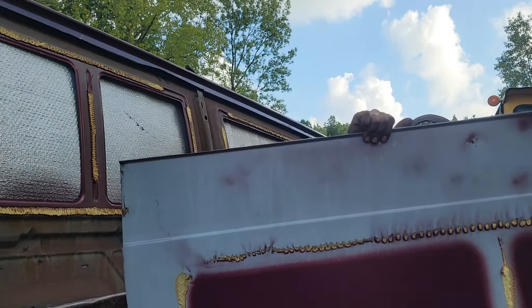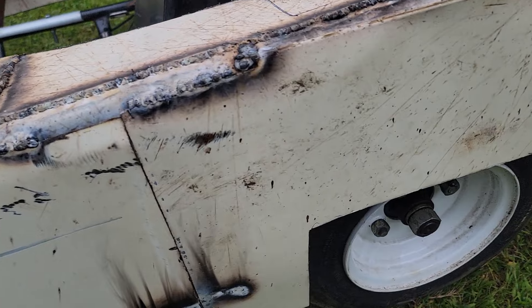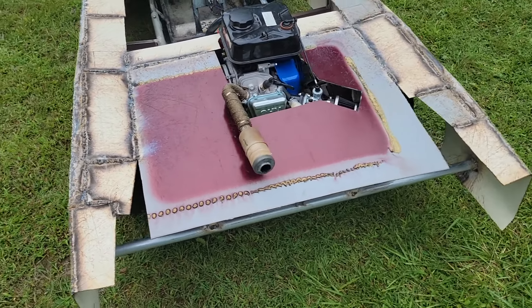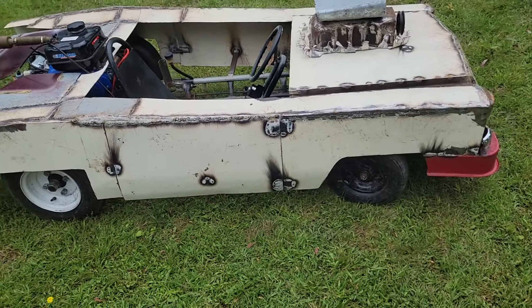There's still a lot of work to do, but I wanted to show you what I did for the body mounts. I got four pieces of pipe — one on the back of the frame coming out to this piece of conduit, and one in the front doing the same. The two side ones push the body out so we have room around the tires and aren't rubbing anything. We're going to take it down the street to check that all the welds and body mounts stayed together. This is where we're at so far.